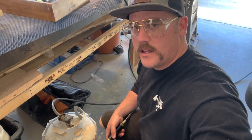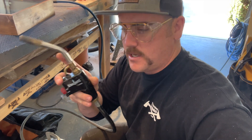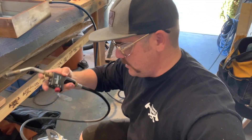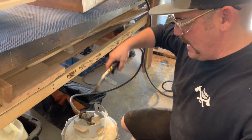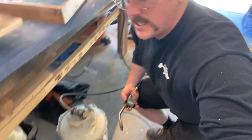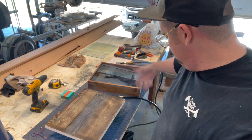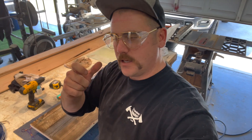Quick side note — a lot of people ask me what I'm using for my propane setup. I have the Bernzomatic gun which comes right on the cylinders. If you buy them from Lowe's or Home Depot you can get a propane barbecue extension hose — kind of what you use for camping with the larger stoves. They connect perfectly together and I have about a four-foot run from my tank to my nozzle. I'm using the Blue Rhino exchangeable tanks and I don't think I've put a new tank on this in about a year doing a lot of burning. I'll put a link in the description on Amazon for where I got that hose and the gun.